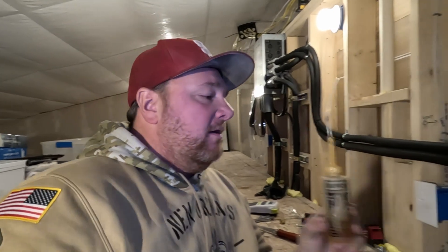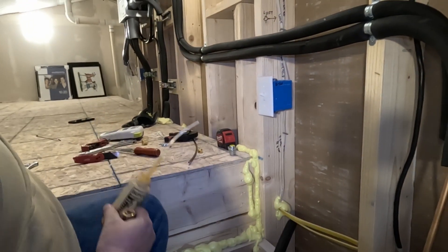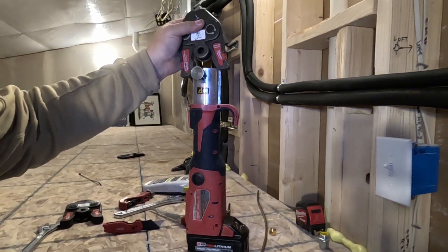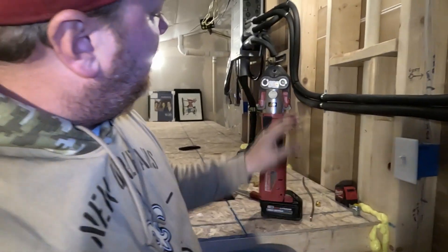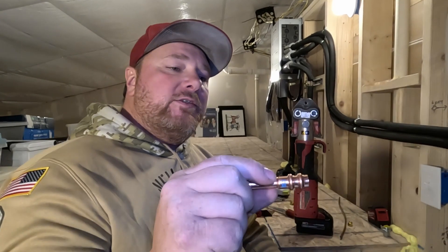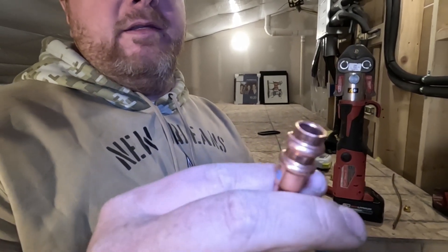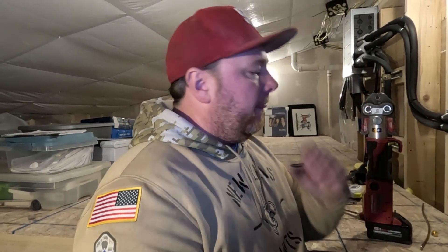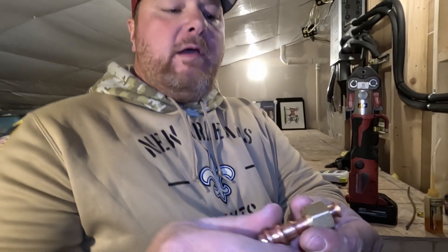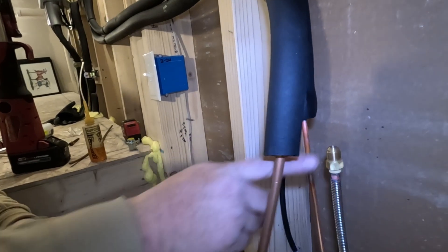Don't leave home without it — this is Zoom Spout oil. We use these on all our flare connections. For this connection we're about to make, we're using the Mitsubishi pro press tool. It's a pretty cool tool that saves your hands and saves you time compared to old school hand flares. The fitting has dual bands that get crimped down and two O-rings to help with the seal — rated to around 680 PSI, way more than this will ever see. I've already oiled these fittings, but I'm going to oil the back side of the flare so that when you're tightening it down, the friction isn't gouging or leaving a cut in your flare. I like to put oil on the nut and a little on the top of the flange.